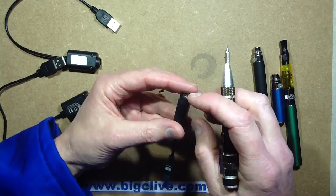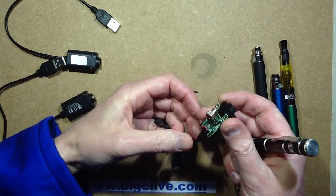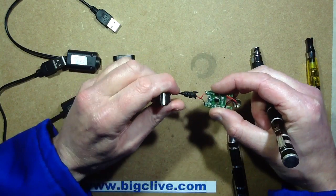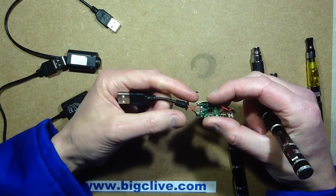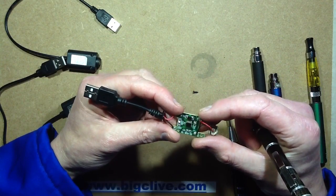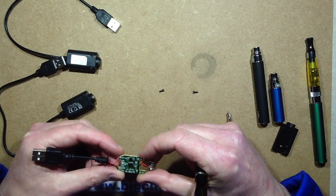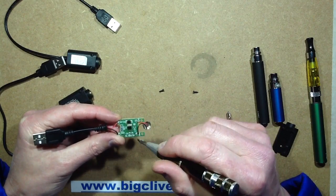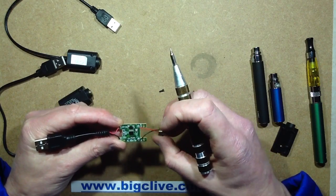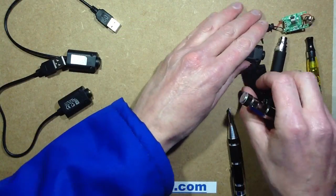Most of these hold together with just two screws, then you prise the case apart until it unclips. The first thing I'm noticing is that there are only two wires coming from the USB connector: positive and negative. That means there's no way it can communicate with the computer, so this is absolutely not going to give your computer a virus. It's got a diode for polarity and a very common 8-pin charge regulator chip that controls the charging of lithium batteries. So that one is not a virus risk.